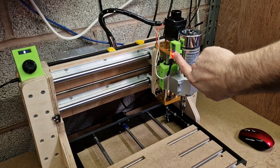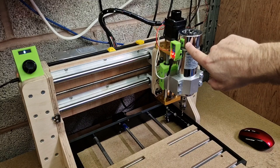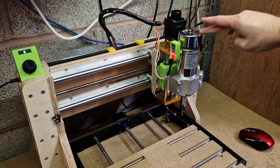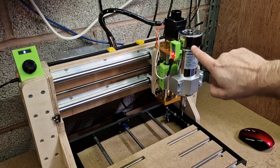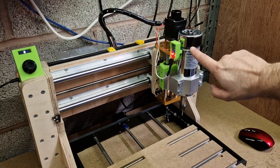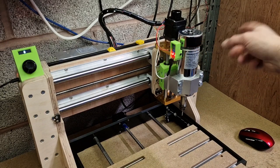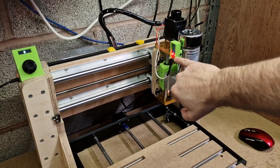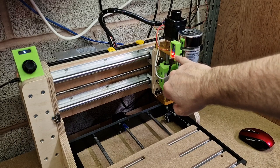It's just a generic infrared proximity sensor and it's literally just looking for the proximity of this fan. You'll notice as it comes around there's a black section on the fan — initially I just used insulation tape, but at high RPMs that has a habit of flying off. So this has now just been painted: I masked a section off, spray painted it black, and put it back on, and it's absolutely fine.